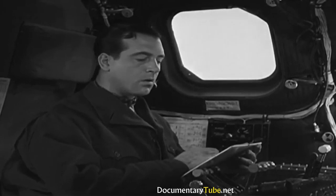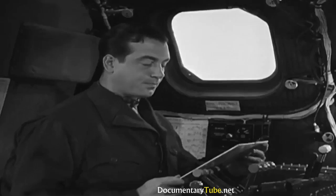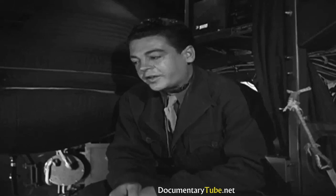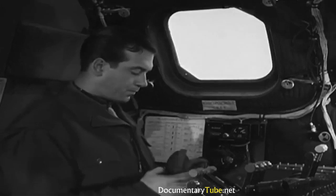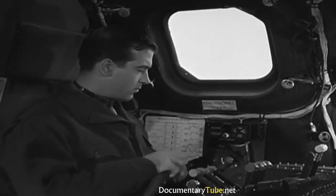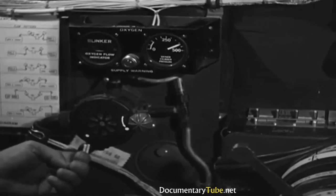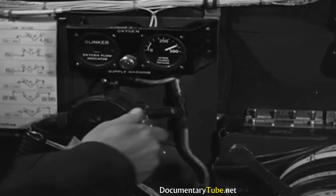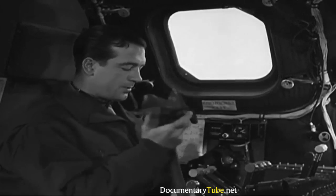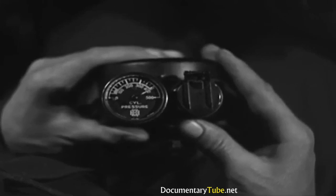Uh-huh. Battery switch. Battery switch on. Next is master ignition switch. Over there. Master ignition switch on. Oxygen equipment? That's right. Well, the mask looks okay. So, plug it in the regulator. Who left that auto mix off? That sure would waste oxygen. Pressure's 425, which is correct. And the emergency valve works. The blinker stays open. So that's that. Now, how about the portable oxygen bottle? Well, it's full. Pressure's 400.